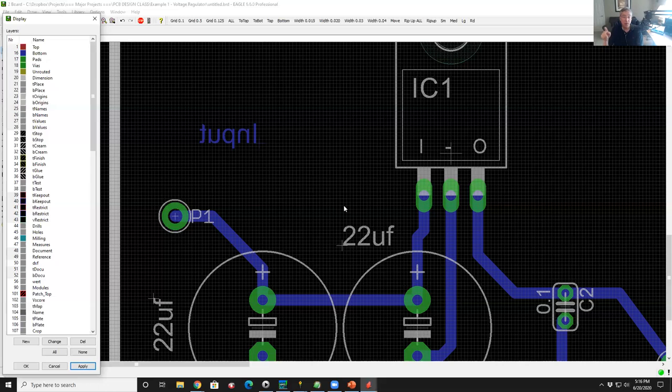Now, when we go to the final step, which is to create the Gerber files, basically matching the layers of the process that go to the fabrication house, there is a piece of software and a set of rules that are run that says, take various layers in the database, take a set of those, and then export them in a certain format, Gerber format, and that's what goes to the fab. So when I said add this text, the last layer that I was playing around with was layer 16, the bottom copper layer. So that's what my text showed up in.